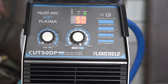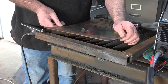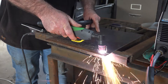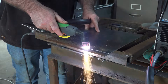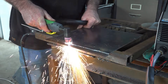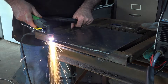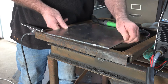We're back at 220 - see it changed back to 220 there. We'll go and do some cutting at 50 amp and see what we can actually cut. We've got some 3mm plate here so we'll work through that at 220 volts. That was no big deal guys, cut through that quite easily, so we'll go up a size a little bit.